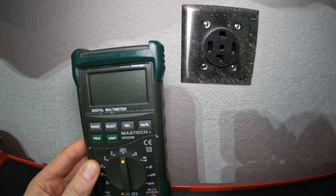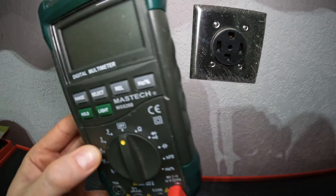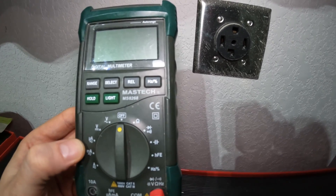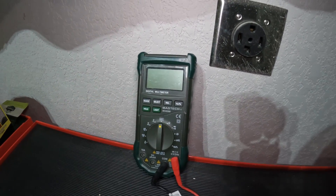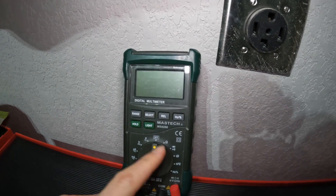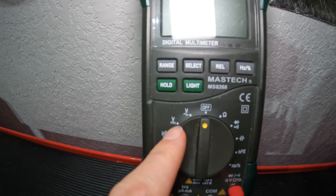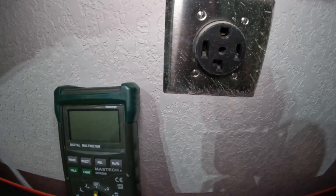What you're going to need is a standard multimeter. I got this one off Amazon or Harbor Freight — I'll put a link in the description for a couple of different meters. This one is a Mastech MS8268. You have four ports down here for plugging in your leads, and a dial to select functions like resistance or voltage. For this test you want AC voltage — note the wave symbol for AC versus the straight line for DC.